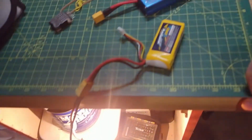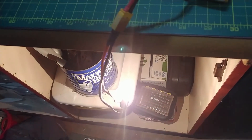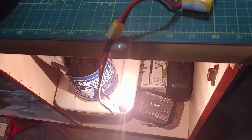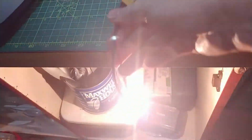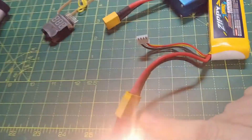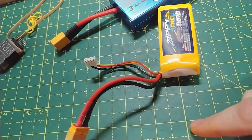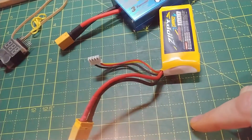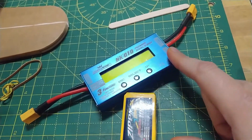What you can do is hook your LiPo battery up to a 12-volt lamp or light. These are commonly found at auto parts stores — basically a 12-volt headlight. Solder your positive and negative onto the light bulb, then put your favorite battery connector on it and wire that up to your LiPo battery to safely discharge it. The thing is, you can't just leave it unattended for a long period of time — you have to monitor or check it every now and then.